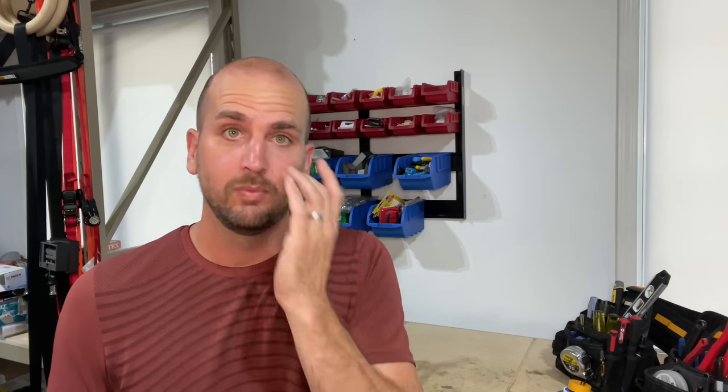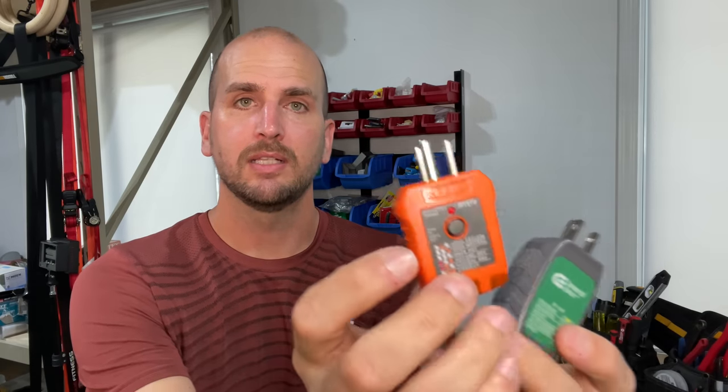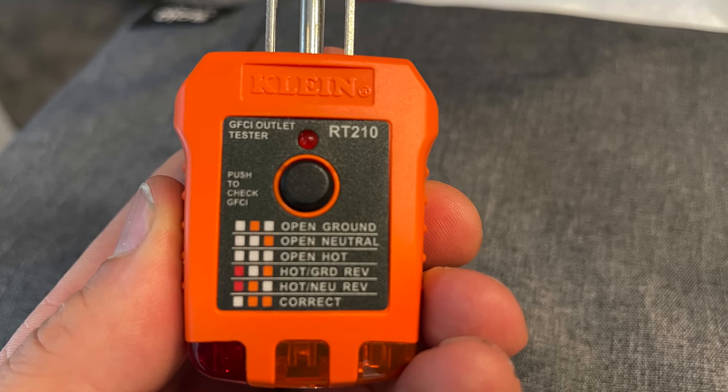If you're working on a receptacle, it's a no-brainer to have some form of outlet tester. These are not battery-powered. There's a cheaper version made by Commercial Electric and a more expensive one made by Klein Tools that also has a GFCI tester so you can verify the GFCI trips properly. When you plug these in, three LEDs light up in different combinations showing if the receptacle is correctly wired or if you have an open ground or open neutral. They're very common in home inspections. You can get one with a GFCI tester for as little as ten dollars.